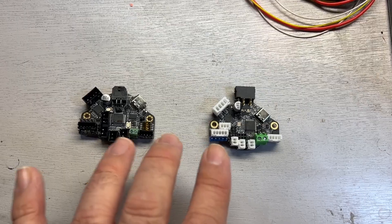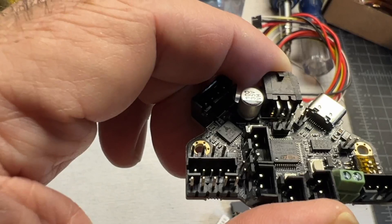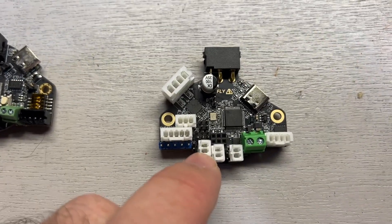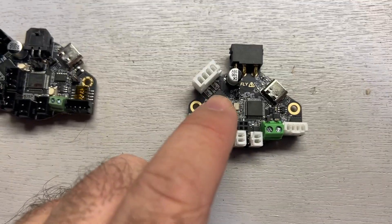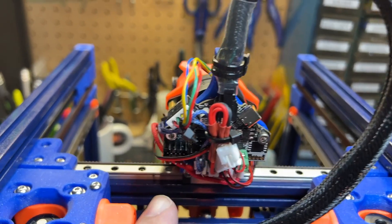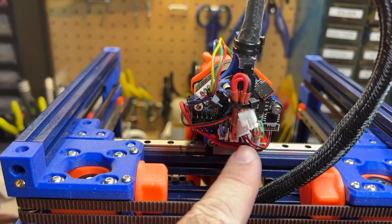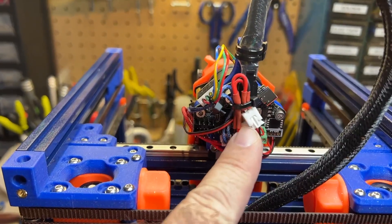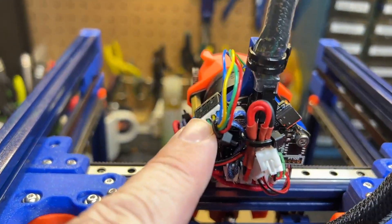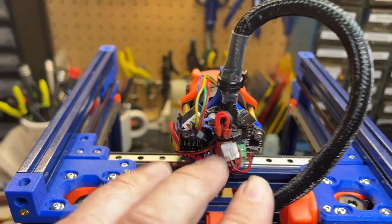You shouldn't have to mess with boot pins on this board anyway unless something goes catastrophically wrong. Both boards are going to be running CAN bus and treated as their own MCU. The BTT board runs an STM32 chip; the Mellowfly runs a different chip — not STM32 but something similar. They both have TMC2209 drivers, which is what runs the extruder motor. The main connections on the V0 are the thermistor, part cooling fan, hot end fan, and since there are only two fan ports, I made a Y cable for the part cooling fans. There are also screw terminals for the hot end heater and the extruder motor. This board also has a built-in accelerometer, so you can run input shaping without a separate one.